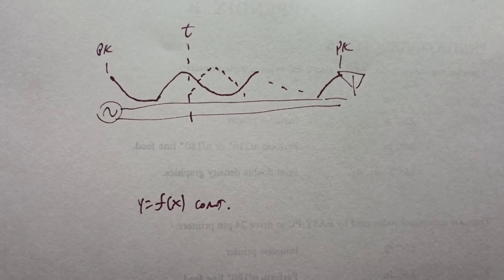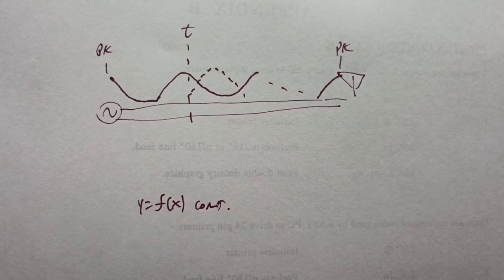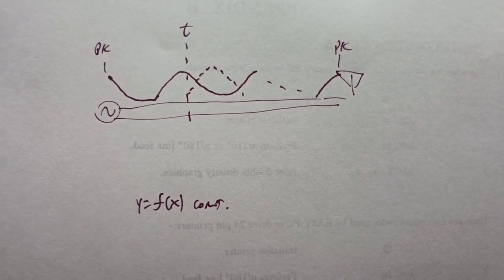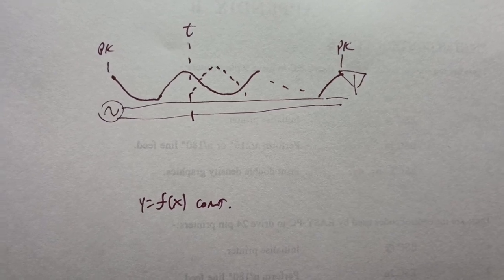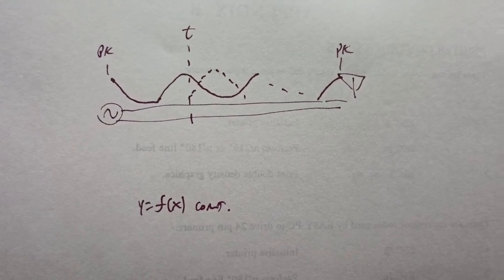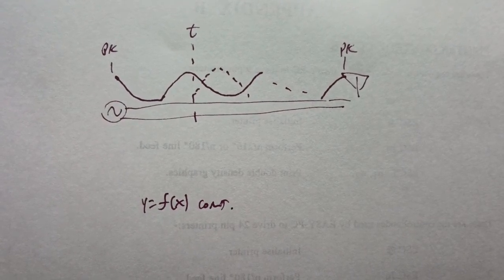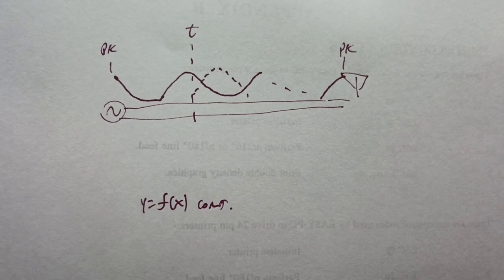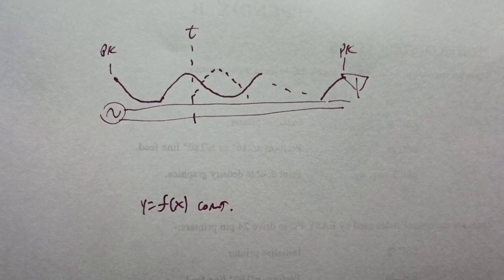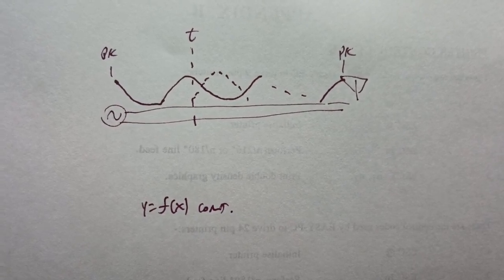Rig Expert came out with a gadget that fastens on the feed point and sends back the data, I think by Bluetooth link. $180. Really not bad, a little high for what it is, but it's a niche product. It's going to be high. But that is the correct way to do it. Go out to an AM broadcast tower, measure at the feed point at the base, not in the transmitter room. But when the feed point is where we can't get to it, or if we have physical limitations like a bad leg or bad back or some such thing, then this kind of thing becomes important.